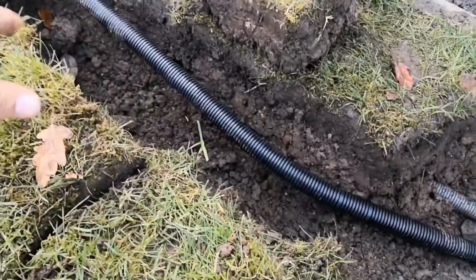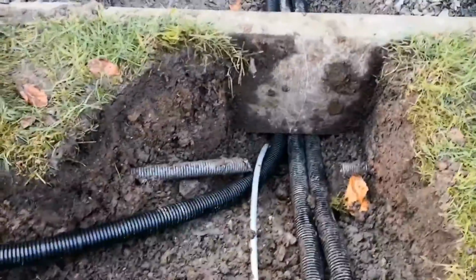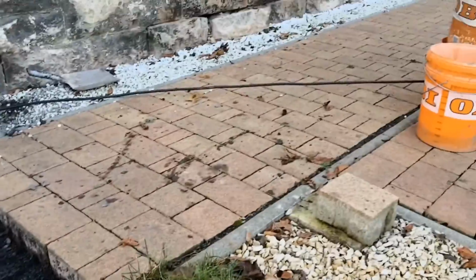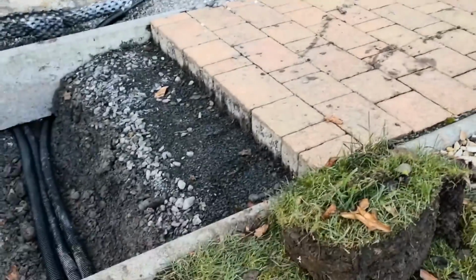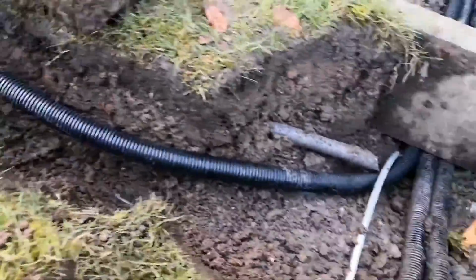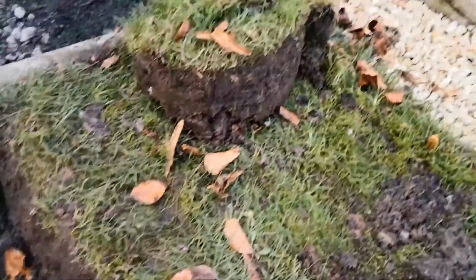The water supply will also be routed through this trench with the necessary infrastructure. Here, I set an angle and install the pipe under the sidewalk. There, just another angle comes, and the pipe runs along the house wall. I will also lay a second PE pipe in this trench as part of the ongoing project and let it end here for future use and potential expansion.